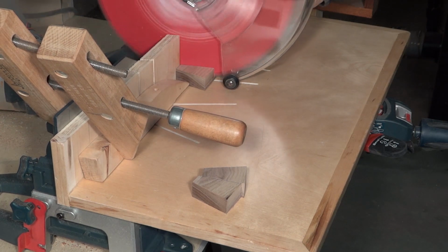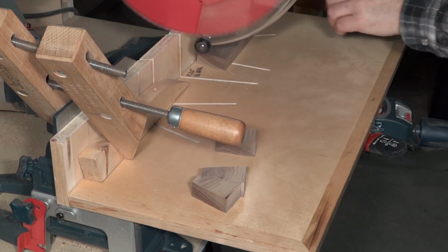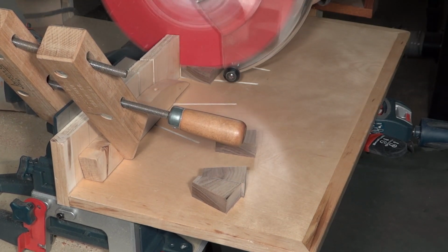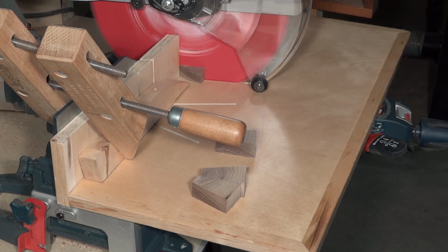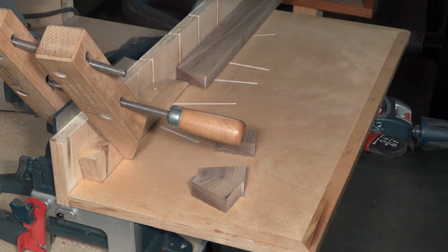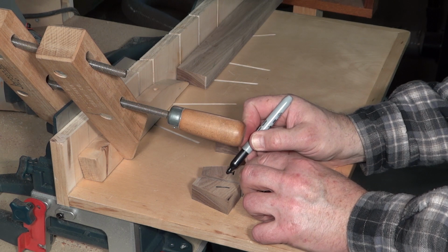After each segment is cut, I flip the board and cut off the smallest amount I can to show another edge the full width of the board. Then I flip it again and push it against the stop to cut the next segment. Doing this makes sure that the outside edge of the ring is from the same side of the board, resulting in a consistent grain pattern. I number each segment to make sure I don't mix them up, which would lose the beauty of the grain pattern.